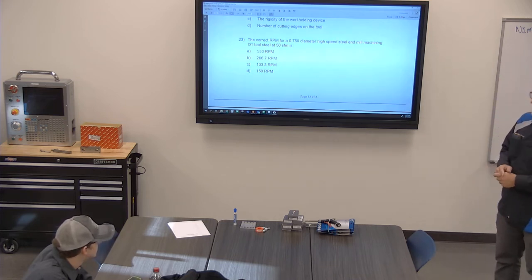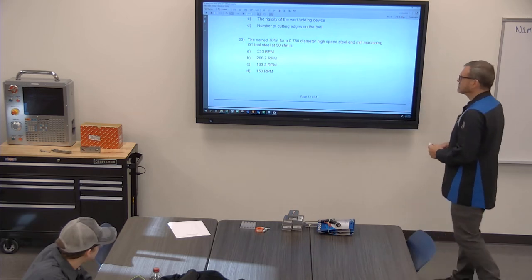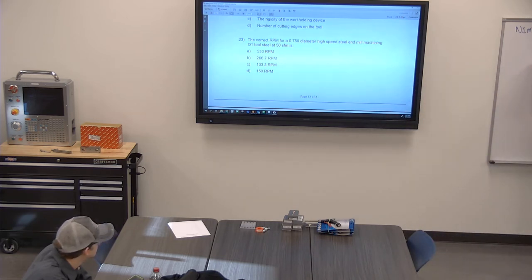Is it B? Why do you think it's B? How did you calculate to B? Which is your surface feet per minute. Did you do times 4? Yeah. Which is the constant-ish, and then divided by what? Diameter. Sorry, I didn't do it right. The diameter is what, 3/4? Is that right? Which is the diameter. And what'd you get? What was your actual number? 266 and then just 6 repeating.